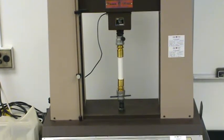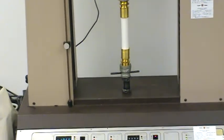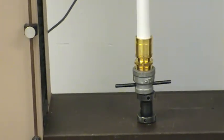You can see this pipe sample is put together with 1-inch Everlock fittings, male pipe thread fittings, and each of those fittings is threaded into adapters we fabricated to connect the pipe to the tensile testing machine.